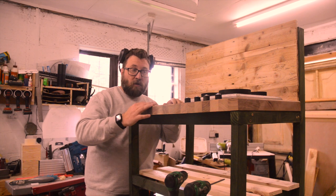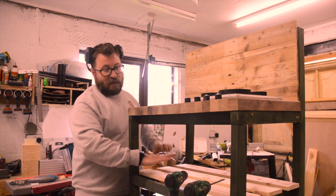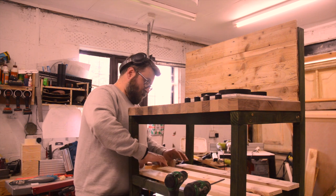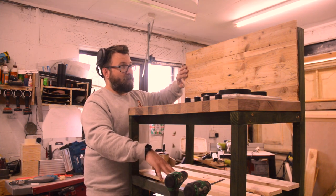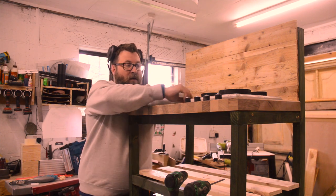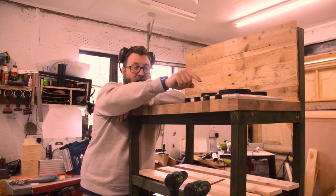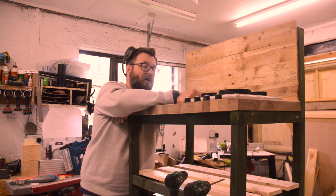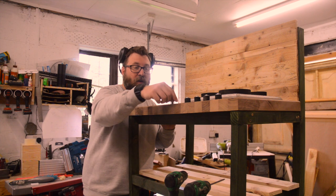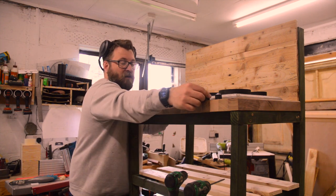I've attached the butcher's block worktop piece with some decking screws from underneath so they're nice and flush. The back piece and the shelf on the bottom are both pieces of pallet boarding which I've sanded down to about 100 grit on all sides. I've put three pieces across the bottom as a simple shelf, and at the back a backboard made of four pieces — all nailed on with the nail gun. I've attached the cooker with four screws into the worktop, and using the hob rings I've covered the screw holes so you can't see them. The cooker knobs are off cuts of plywood cut into small circles, attached with pocket hole screws which are nicely domed and silver, giving them a different look and feel on the front.